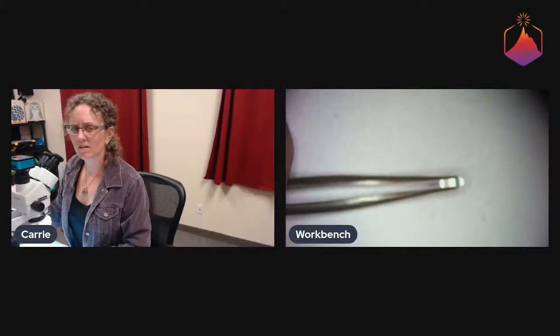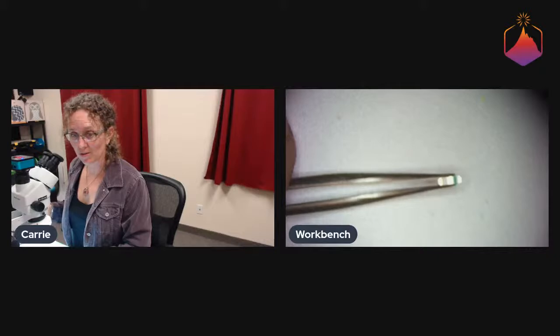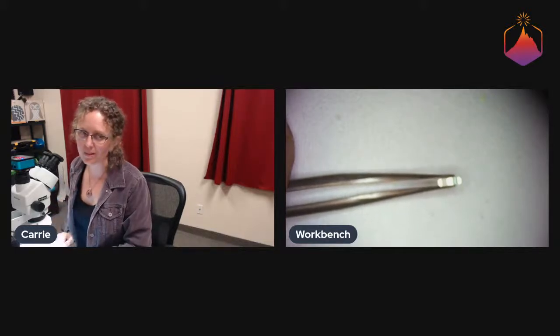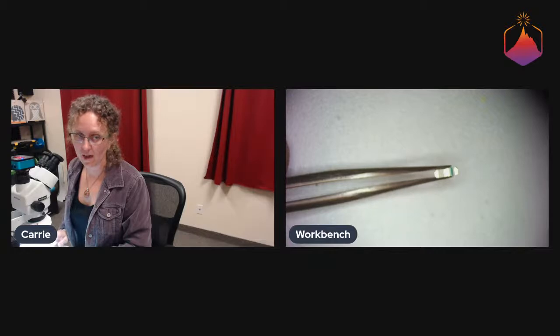There's a middle one that is not electrically connected to anything. That is just for solder stability. I did not put that in my footprint because we wanted to do the Hacker Challenge version where we give you just a kit of parts and you solder it up yourself and program it yourself. I thought that having an extra pad in the middle would make this part finer pitch and easier to bridge. And we're not super concerned if it's not perfectly square to the pads. If it's a little bit skewed, like 30 degrees or something, it's not going to make a difference. So that pad we have not put on.